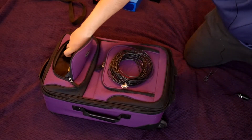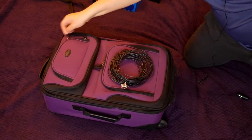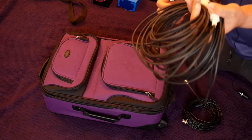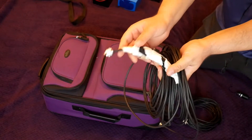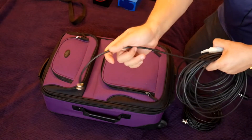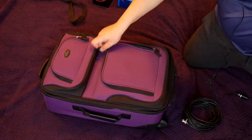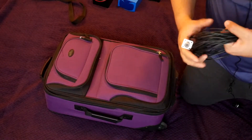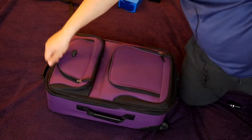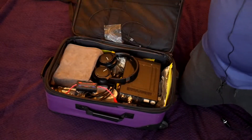I do carry some tools which I have found useful sometimes — just multi-tools like pliers and knives and stuff like that. Over here in the other compartment I have the coax. It's just RG-58 with PL-259 on one side — that's the side I connect to the antenna. I do have some snap-on ferrites on the coax. And on the other side I have a BNC connector, which you might find a bit unusual, but if you see my video on BNC connectors you'll see why. I just love BNC connectors; they're great for portable operation — so easy to connect and disconnect on the go. Basically, the antenna wire and coax are in the outside pocket, and all the equipment is separately inside, so the long wire and coax don't get tangled up with the other stuff.